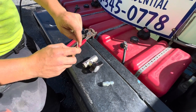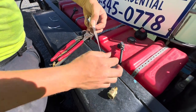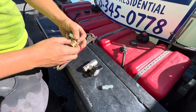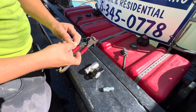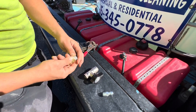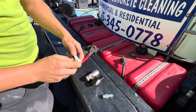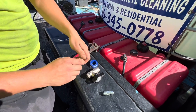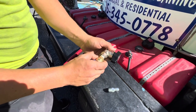Really, Teflon is not really a sealant per se. The reason why we want to use Teflon is just to lubricate those threads so we can get a good thread going in and not cross-thread, that sort of thing. So in a pinch — I made another video on this a few months ago — in a pinch you could use a piece of plastic Walmart bag. I've got some pieces that have been together for years like that. I'm not saying go do it, but if you didn't have any Teflon with you and you need to put these things together. Anyway, we've got it Teflon'd up and we're going to go ahead and tighten it up.